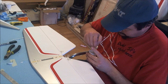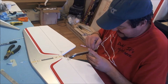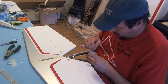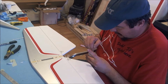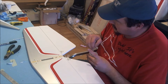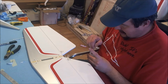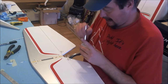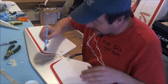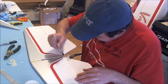All right. Got our epoxy thawed out there. It's a 20 drop ratio. The way it's been going lately, I really have only about 20 minutes to work. When I heat it up, it kind of speeds up the set time on it. I noticed that yesterday. What did I epoxy yesterday? Anyway, I noticed that 20 minutes went by and the mixing cup was getting hot, and usually when it gets real hot like that, the epoxy is setting.